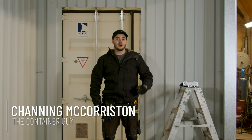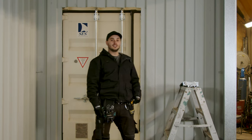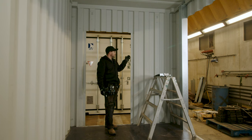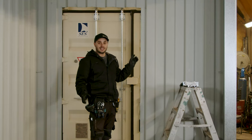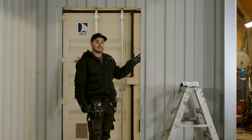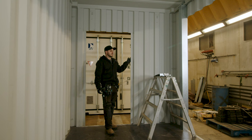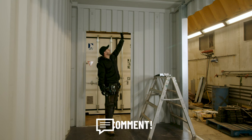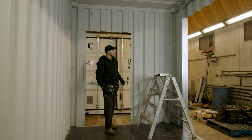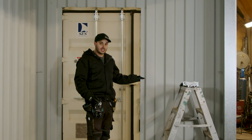The guys have already cut out all of the openings in this container before they brought it into the shop. When you're cutting out the man door openings, you've got to be careful to always make sure that you're doing it on an outside corrugation. That makes sure that the flange on the man door — these dual swinger container modification rolled man doors — can actually grab something. This is being installed on the end wall corrugation, and those corrugations are actually a bit deeper than the side wall corrugations, so they use a different rain drip that stops water from getting back in and leaking in the container.